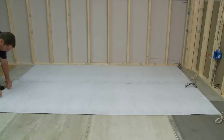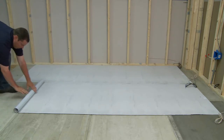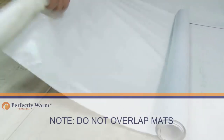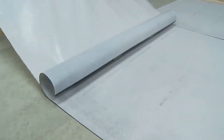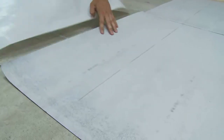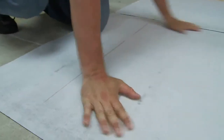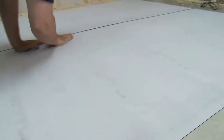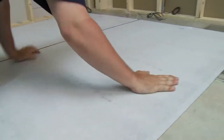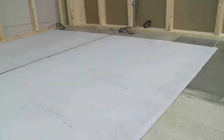For adjacent mats, follow the same procedure starting with alignment of side-by-side mats in a butt-joint fashion. Do not overlap mats. Peel off the quick-release liner and set mat in place, leaving clearance to walls or partitions at the connector end for wiring and final connections. Please ensure to take care in the placement of the heating mats, as once the adhesive side of the mat comes in contact with the primed surface, it will provide a very strong bond.